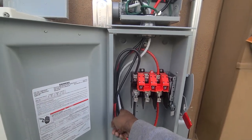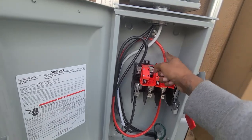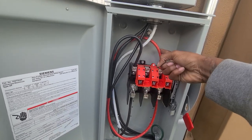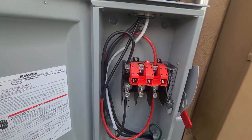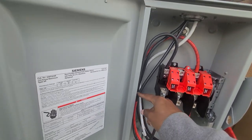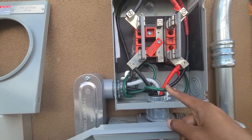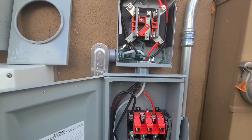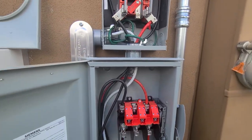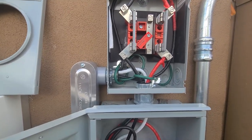The breaker needs to be wired to the top of the disconnect. You see red and black - it's wired to the top. You can follow this wire; it's wired to the top. Now we come to the bottom of the disconnect. This bottom of the disconnect is gonna follow up to the bottom of the meter. That's how you properly - not even just for batteries, but in general when you're wiring your disconnect, your meter to your panel - this is gonna be the way it connects every time so you don't fail inspections.